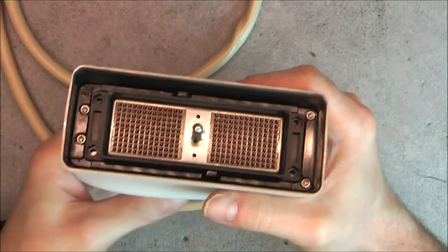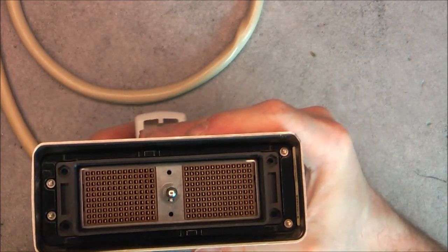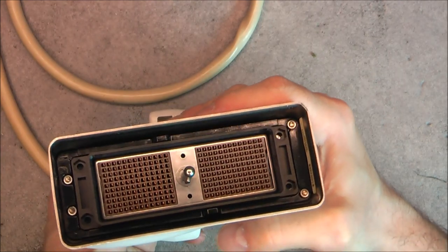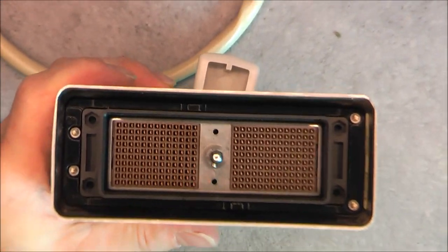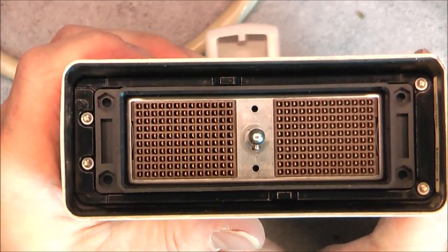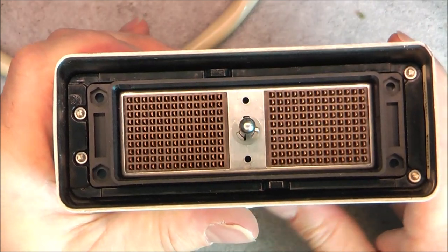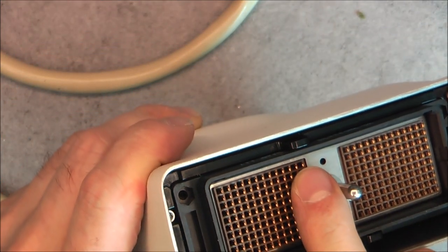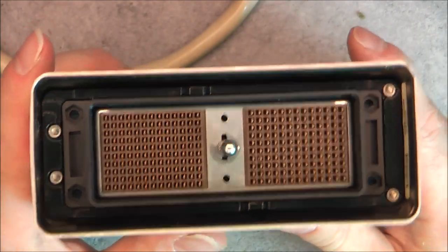And we have the regular multi-pin ultrasound probe connector with golden pins that will actually make contact not from the end but from the side. Because if you look closely, when I turn the handle, it will move them and they will mate on the matching connector on the side. Here we have a little ball each time that makes the contact.